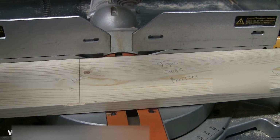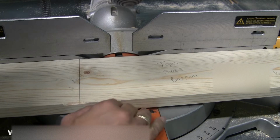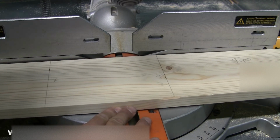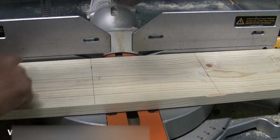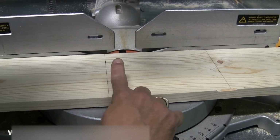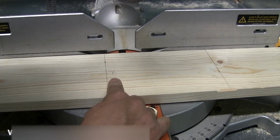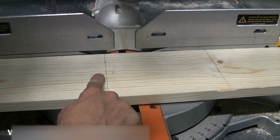All right, so this is a front view of our miter saw here at school. Be sure that you know how to safely use this before you make a cut. I make my students pass a safety test. As I bring my piece through, you can see that I have a line with an X on it. I wanna make sure that when I bring my blade down, the side of the blade comes right to the edge of this line and will go over the top of the X. If I put the blade on the other side, I will end up with a piece that's too short.